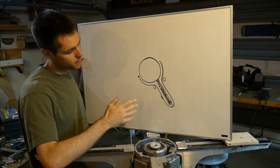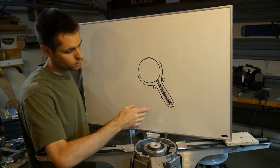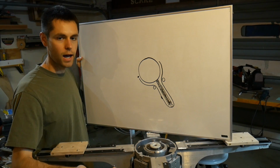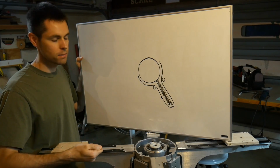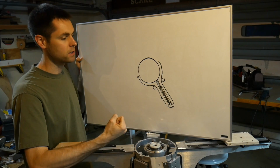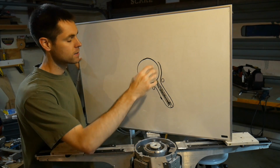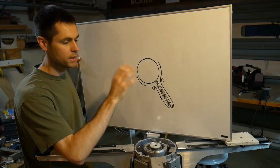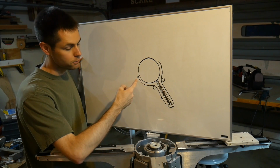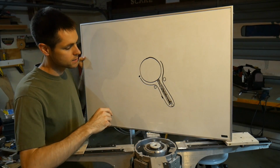There are some finer points on this, like you want to make sure that your travel in the direction which is most likely to receive high force, like someone pulling out, for example, on the panel, is going to be against the hard point that's anchored so that it wouldn't have any spring. Because you don't want to have a super stiff spring over here. Stiff enough to keep the slack out, I mean, that's its purpose, but you want the main motion to be against a hard stop if you can. Obviously, it's going to have to be some against here, but we want to prioritize there.